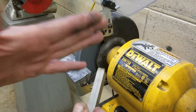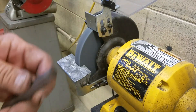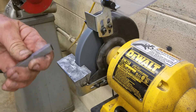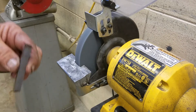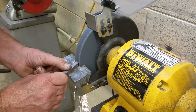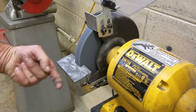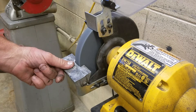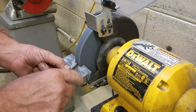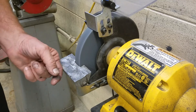I'm not going to grind the whole tool for you because we would be on this video for quite some time, so I'll just show you how to get started grinding these. The key thing is to get those hands in place — this finger right here, this thumb right here. That way you're not going to get hurt or fall into it. The thumb holds it down; the tool has to stay flat the whole time. You don't want your tool rolling around — it's a bad thing.